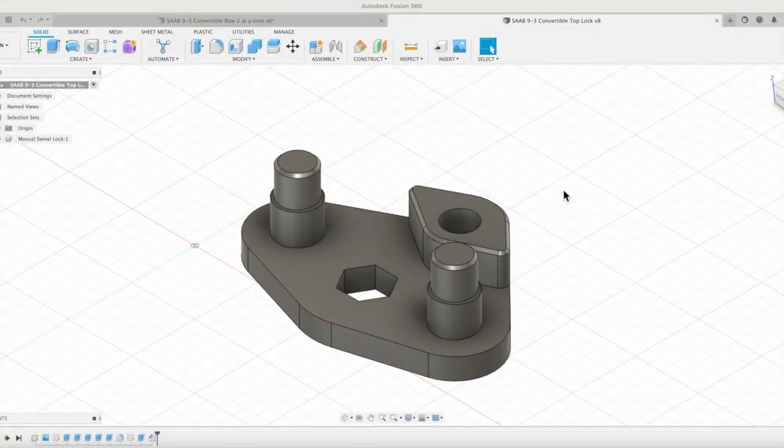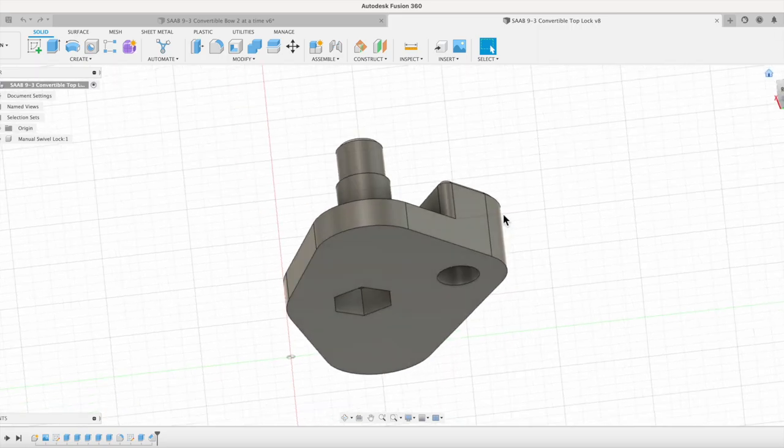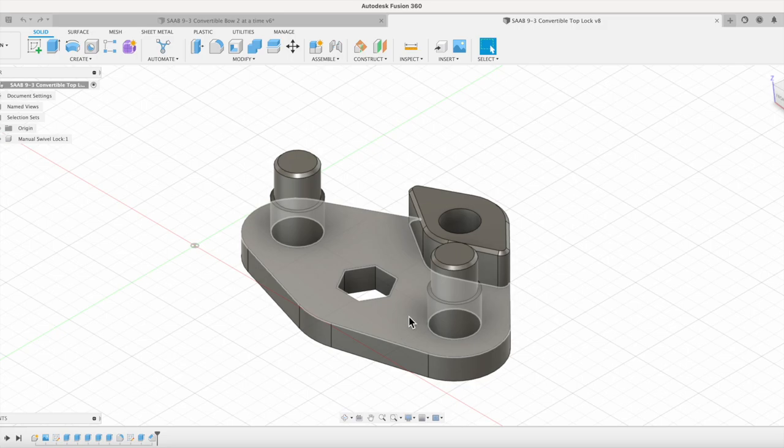All right, so let's pick up where we left off on our prototype on this part. Last time I made this, I really only machined the top side. The back side, all this contour, I cut out by hand, and I just hit that on the grinder instead of making the extra pieces and parts that I needed to be able to flip it over. Even the counter bore, I didn't put that into the drawing since I just did that manually on a manual mill. So I kind of halfway designed this, did all the complicated parts in Fusion, all these contours, and did all those complicated parts on the CNC, and then just finished the backside, finished the contour by hand.